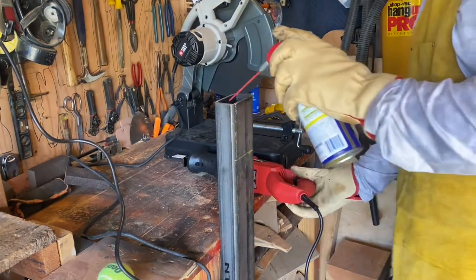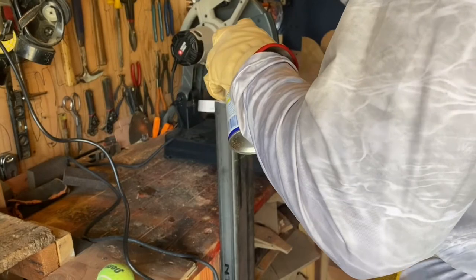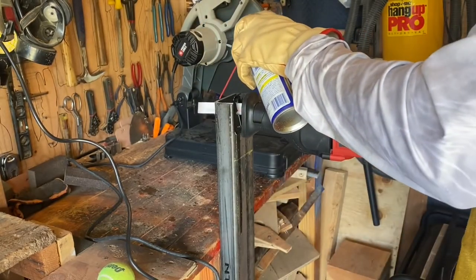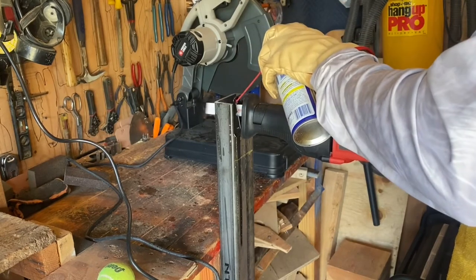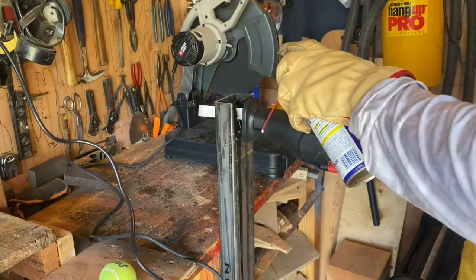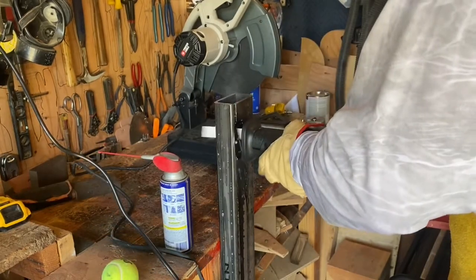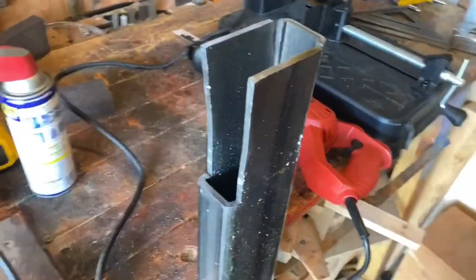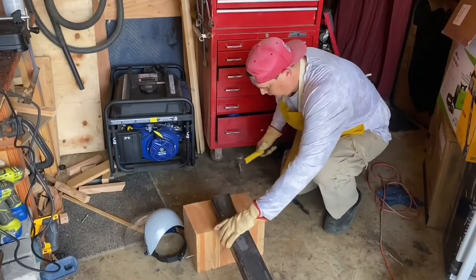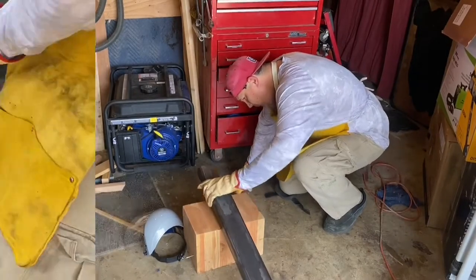You might be laughing at me a little bit here — I don't have any cooling oil, so I'm using a little WD-40 to keep my blade cool. It's just what I had on hand; probably not the best for this. Here's the finished cut. I was happy to see that once I cut it loose, the sides actually started to bend out, which made it a whole lot easier to shape the way I wanted. My old wooden block is serving as an anvil, but I was able to bend it out fairly easily and get the shape I desired.